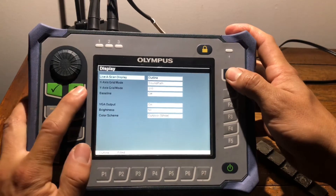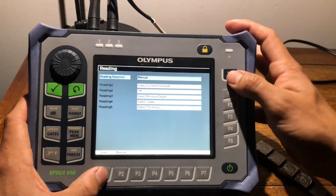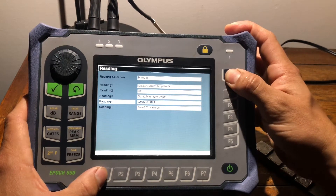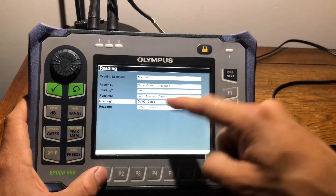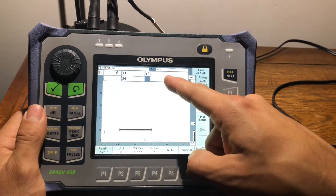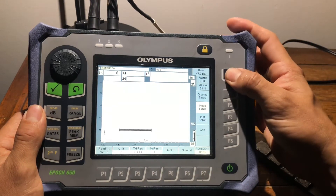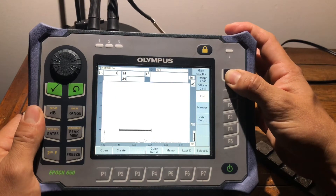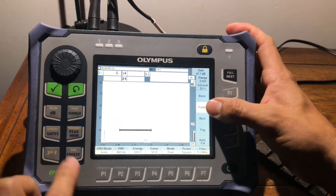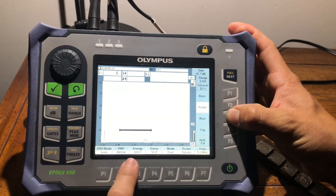Measure setup is an important part. Our gate amplitude will give us what amplitude we're at. This is gate two — this is for your second gate, your thickness. Gate one will be reading this big box right here, and this is for your echo-to-echo, but for this video we don't have that on so we don't need it. I'll give you a rundown on how everything looks. Make sure you're on dual 5 megahertz frequency — this is auto — I have my energy at 200.